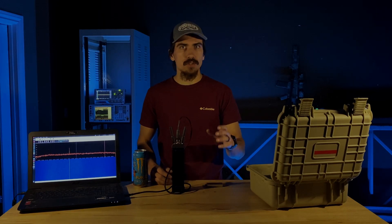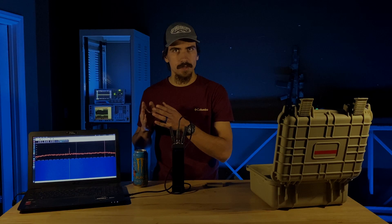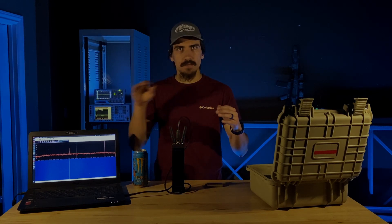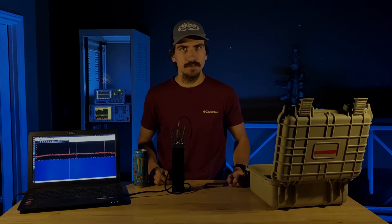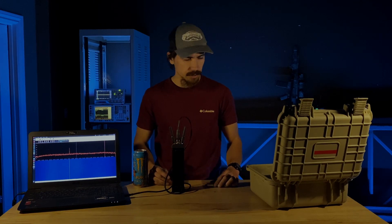Having two SDRs provides much more than just twice the bandwidth. One SDR can act as a dedicated tuner while the other performs different functions — such as listening to a public safety control channel on a trunked network and telling the other tuner which frequency to jump to, or having the second tuner do a wideband scan picking up peaks and having the first tuner jump to those frequencies. You can also run them independently, or have one listening for ADS-B packets monitoring aircraft while the other monitors the general frequency spectrum.